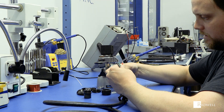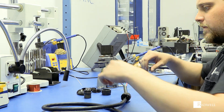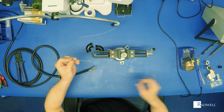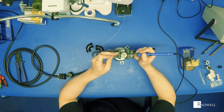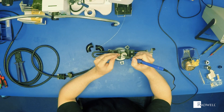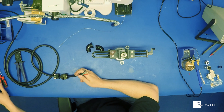If you are doing a feedback cable that has two ends — maybe a D-sub on one side and a military style connector on the other — if you forget to pre-thread the hardware onto the cable before soldering, you will be unsoldering your whole connector and redoing it again. My favorite technique is filling the solder cup with solder first, then tinning the wires, so that all I have to do to connect them is apply a little heat and press the wire into place. This also keeps a lot of heat off the cable itself, which is good for longevity.